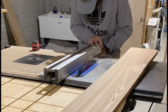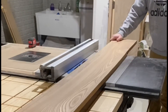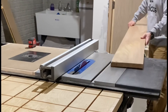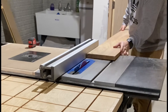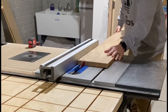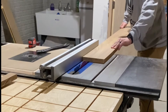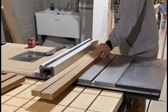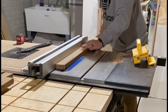Because I'm going to laminate the boards, I actually need four boards — two for one rail and two for the other. So I'm going to run this through and get my four boards, cutting them to about one and seven-eighths inches. Red elm has a tendency to be a little squirrely, so the cuts did take me a little longer because I was cutting through some grains that kept crisscrossing. But in the end I got one, two, three, and then on my last pass the fourth board with very little waste left over.